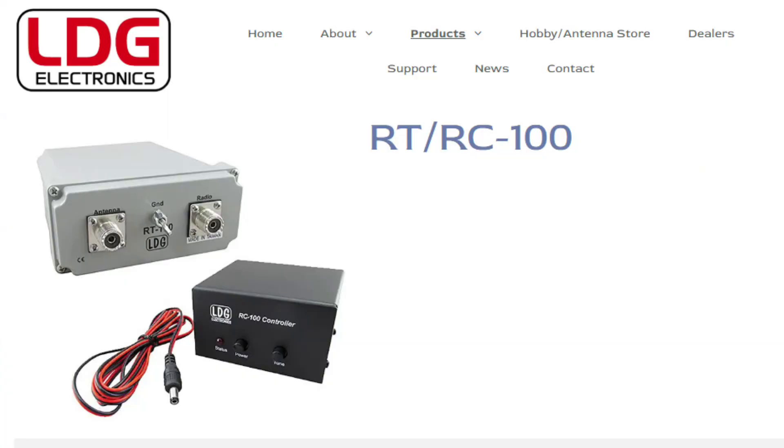The wire we used was AWG24 — get some gray wire like that and you hardly see it, and it can handle 100 watts. With a standard antenna tuner feeding the antenna directly, we were able to tune it up just fine. You can do the same thing with an LDG tuner. One thing to note: these external antenna tuners often need to get powered over the coax, so you need a lightning arrestor that will pass that low voltage. That's not the norm for Polyphaser or Morten, but it is for Alpha Delta — the DC continuity lightning arrestors from Polyphaser and Morten do handle that.